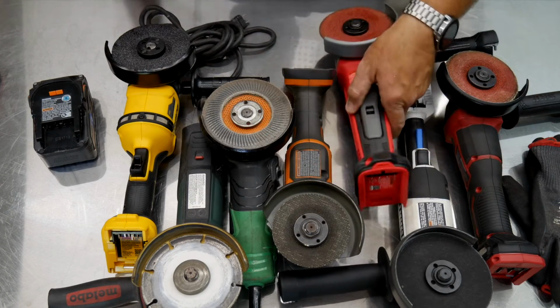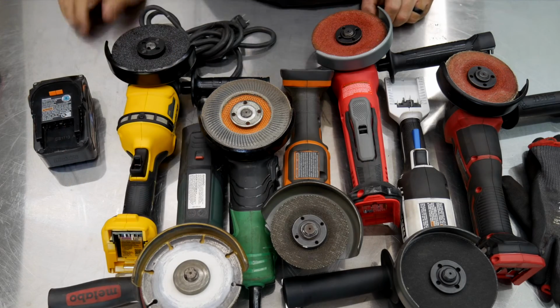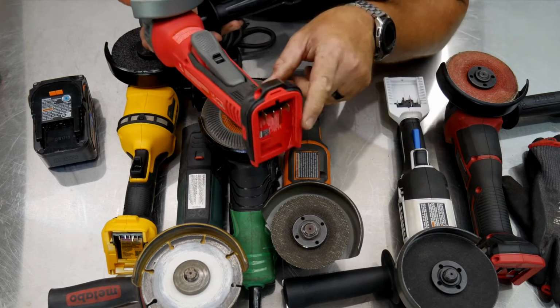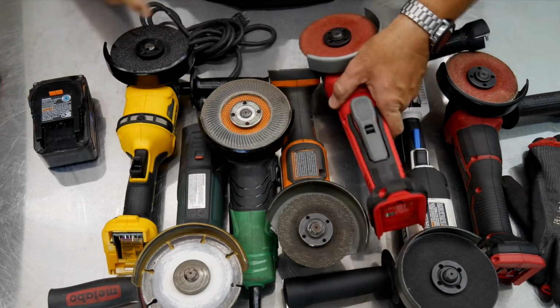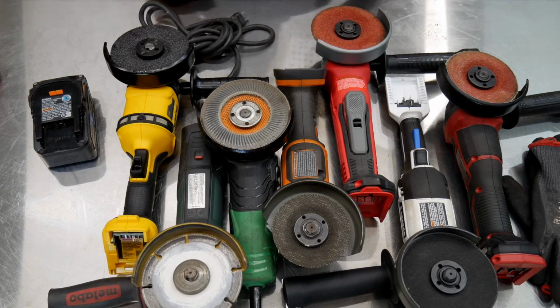You don't need any spanner wrenches. You don't need special spanner nuts on there with knurling on it. Any of these can be tool-free blade changes. Listen, take safety in your own hands. Don't listen to someone else tell you about safety. Depower the tool, take the battery out, unplug it, grab that blade with your hand, spin that off, and you're not gonna have any trouble.